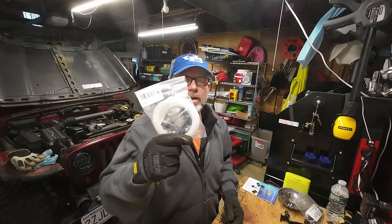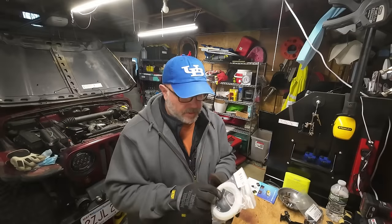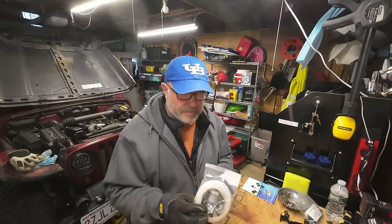I have a code E08 and E10. Both of them are fuel related. So I've ordered a fuel line kit off Amazon. I'll put the link in the description. Comes with hose, an inline filter, some clamps. The pump sounds like it's still working, so I didn't order a pump, but I got to get the heater disassembled, and we're going to get it up on the workbench and see if we can run some new fuel line and figure out this problem.